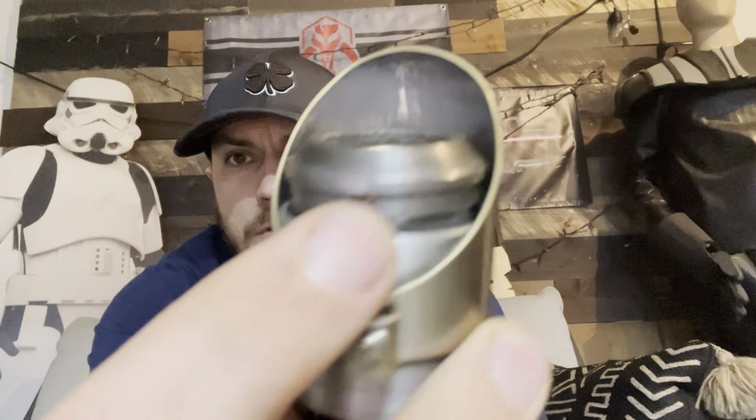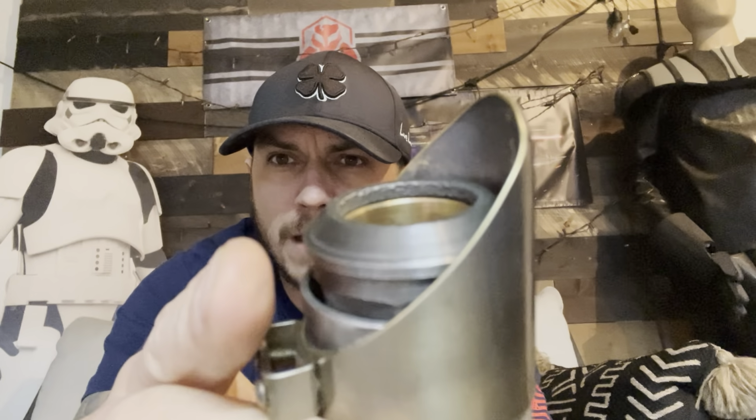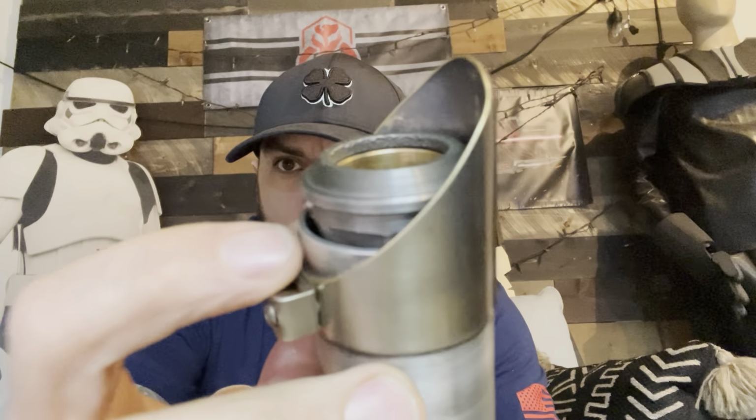So now that we've already seen it without a blade, I'm just gonna go ahead and stick a blade in it real quick. Your blade retention screw is right here. It's a small guy because I didn't want it protruding out at all. Even when it's out of the blade socket, I did not want it coming out of here so it wouldn't be an eyesore. So I put a small 8/32 grub screw in there. So we'll just put this 7/8 blade in, make sure it's engaged on all the pins, tighten down the set screw. And then you could swing on as well if you want.